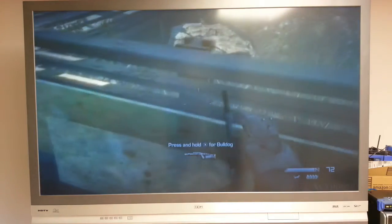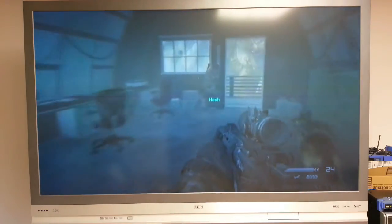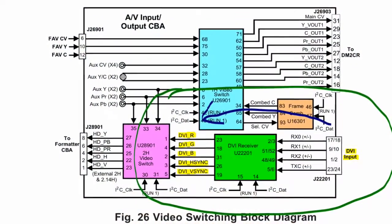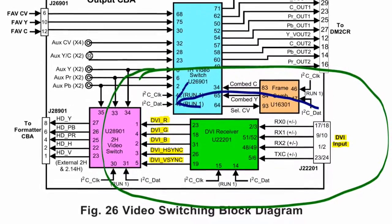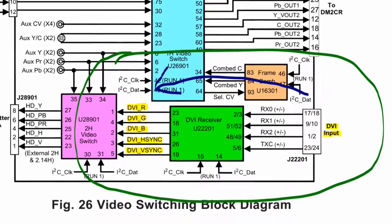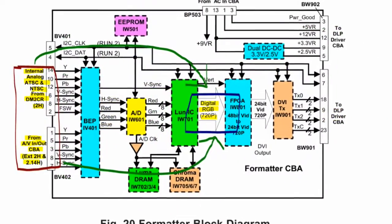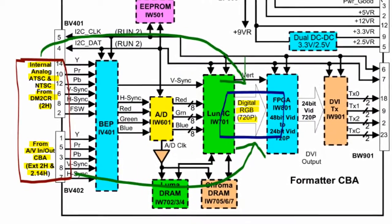The other side effect of reusing that analog front end is that the DVI port is totally bogus. That's not to say that it doesn't do anything — it does work, but right behind it is actually a digital-to-analog converter. So when you plug in a DVI source thinking that you're going to get a lossless digital picture on the screen, you have been deceived, because immediately after entering the set, that digital video is converted back to analog and then goes to the formatter board where it's converted back to digital to be displayed by the light engine. So a lot of unnecessary conversion goes on here.